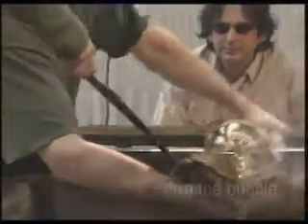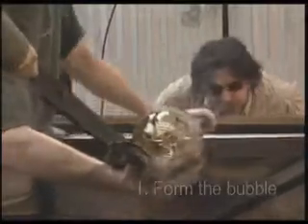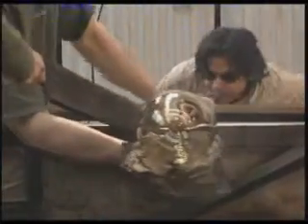The vessels are created as pairs using horizontal and vertical shapes. A given amount of glass is gathered on the blowpipe, then shaped in a wooden block. It's chilled at the marvering table, and the glass is distributed around the bubble. The glass takes shape as it is rolled on the bench and formed with a piece of wet newspaper, as the assistant inflates the bubble to the correct volume.